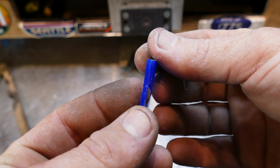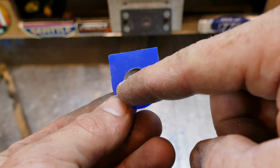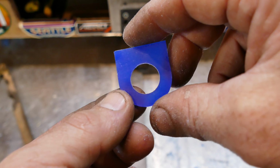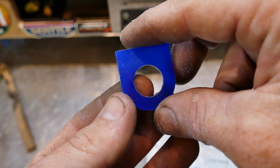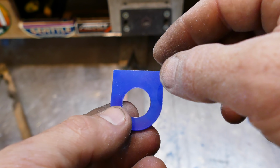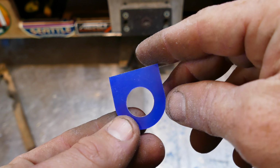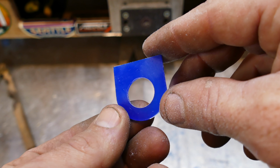And now we're down to the right thickness, which is great. So what we need to do now is mark our shape of our signet ring in here. And I'm gonna go with about a 1.8 millimeter ring shank and then about 2.25 millimeters for the flat top up here. That's about all I want. So we're gonna mark that all out and then we're going to cut it out.